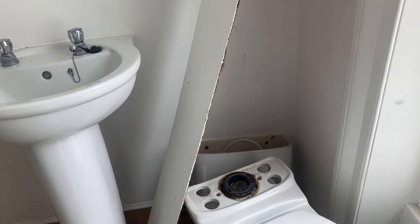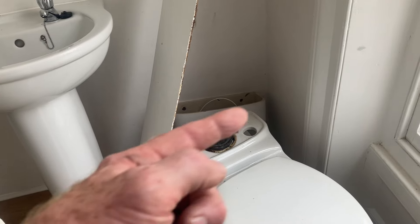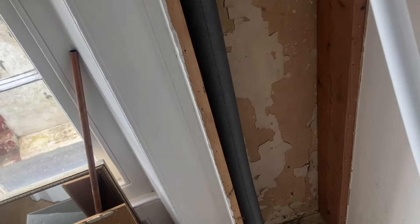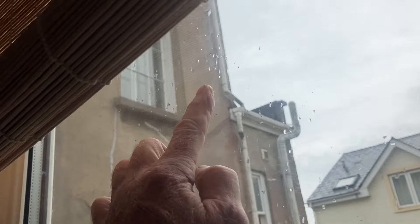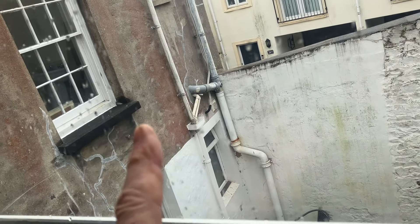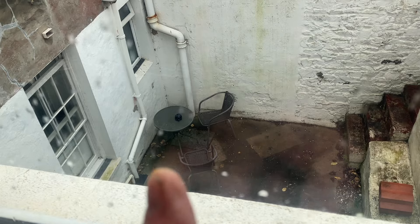That sink's not going to be used. We're going to have the loo — the old loo is going to go here, and the soil pipe is going to go out through the wall there. We've got a couple of options with the soil pipe — it might go in this boxing. If I go around to the kitchen: this plan has been drawn, so I don't know how much we have to stick to the plans — we've got to speak to the architect. At the moment it's going to come out here, drop down the wall. The other loo is here, so that'll have to pick up onto it, then it goes down to the ground about where that gully is.